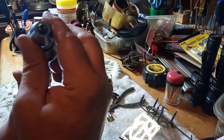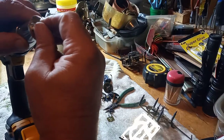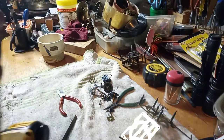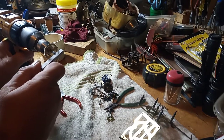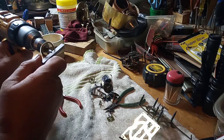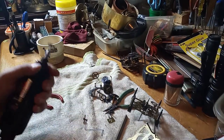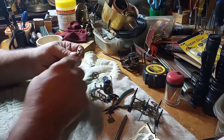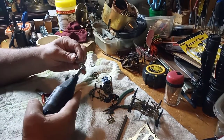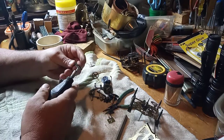I've got an Arkansas wet stone — it's not taking material away, it's just polishing the pivots themselves. I don't have a lathe for this job so I use my Dremel when I can, and if I can't use my Dremel I have a DeWalt that I use. I have an attachment for my DeWalt that closes all the way so you can put these gears into it. I also have a wire brush in my Dremel and I'm going to take that wire brush to the pivots and to the verge assembly itself to clean off any burrs.